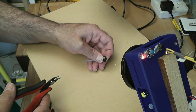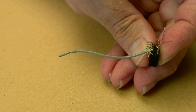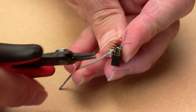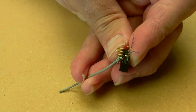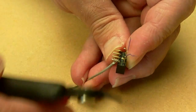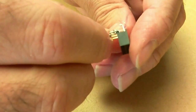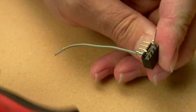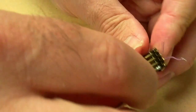So, supposing you have an intricate little joint and you want to make a nice joint with some stranded wire like that. These pliers can be quite useful when you're actually winding round. I've just got some stranded wire I'm trying to solder onto a small header. So what I would then do is take these and snip off the little strands — see how easily they came off beautifully. And then I would solder my joint, so that's soldered nicely in place — well, maybe not very nicely, but it is soldered in place. And then if you wanted or needed to, you could trim off any sticking-out bits to avoid any problems.